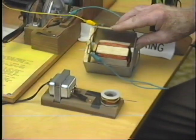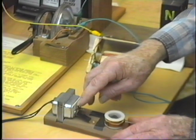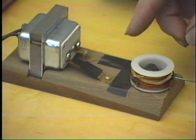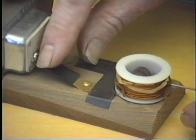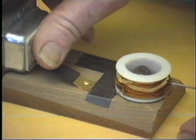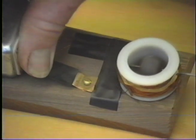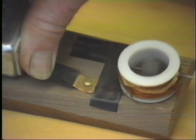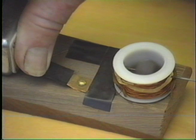I want to show you a couple of other little motors — different kinds. One of them is a little motor timed by the power company clock, the PG&E clock. If I push down the switch, I'll put an alternating current into this coil so the current flows one way and creates a magnetic field, then goes back the other way and creates the reverse magnetic field. Every time that field changes direction, the magnet has to flip over. You can see that little wheel is going to turn. It has to go with the 60-cycle current, and it has to be timed with it — there's no way of changing that timing unless you change the frequency of the current. It's a little motor synchronized by the PG&E clock.